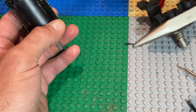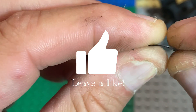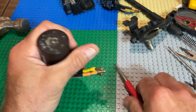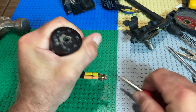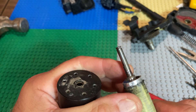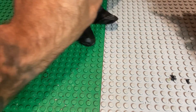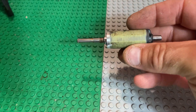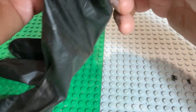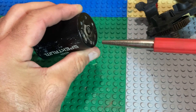Now just take that punch and you'll be able to pop the rotor right out. It's important — don't set it down because you may have some debris and filings. Remember, this thing is heavily magnetized. I put it right inside a nitrile glove to ensure you don't pick up any crap off your workbench and keep it nice and clean until you're ready to reinstall.